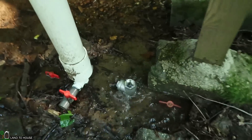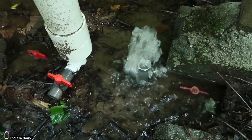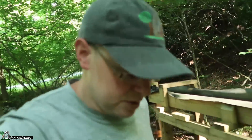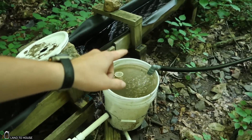This stainless valve is working well. I'm going to give it a good couple of months of operation and see how well it lasts. One thing I'm noticing is that the valve is heavier, so it requires more water to close the valve — meaning your source is going to have to have more water than with the brass valve. I came up to my bucket intake and noticed it was pulling more water than I had going in. I have a one-inch supply line, and I had to go clean out the intake to get enough water flowing through.